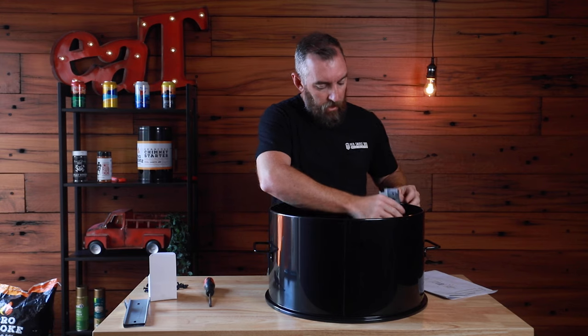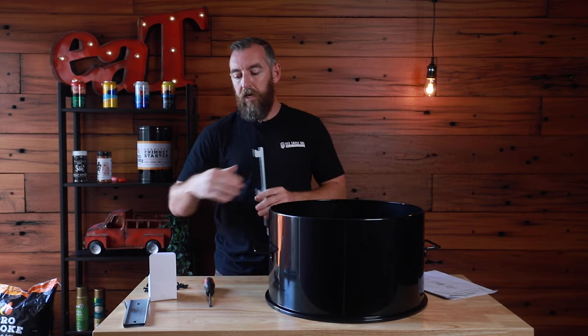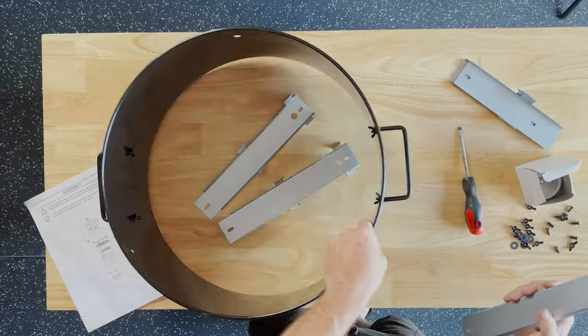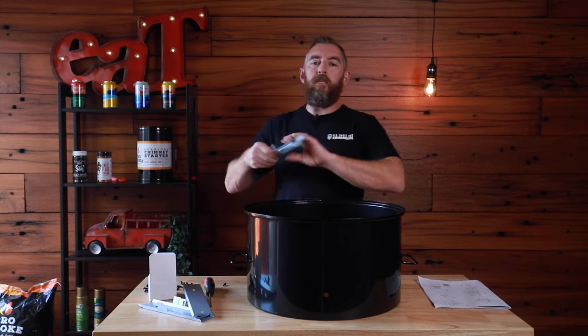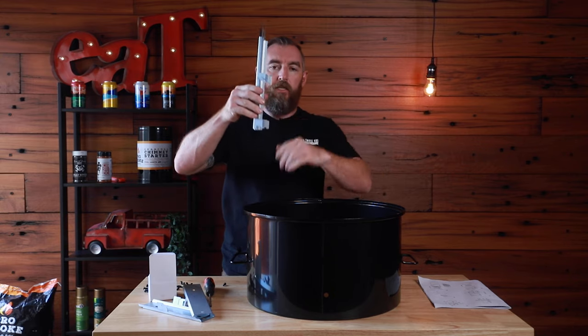And there's a little hole on the side. And then these little sections down the bottom are gonna hang lower than the drum because they're gonna connect to the bottom rings. So don't worry about it if they hang. So for that, let's flip this upside down so that the hole for the temperature gauge is actually at the bottom. Now, that means with your brackets here, what you need to do is put them upside down too. So the hook needs to be facing down.